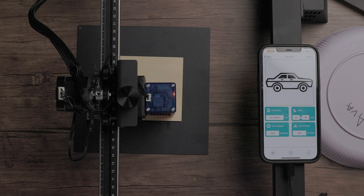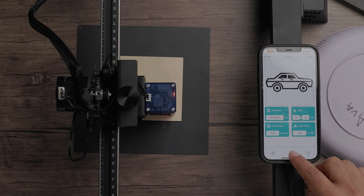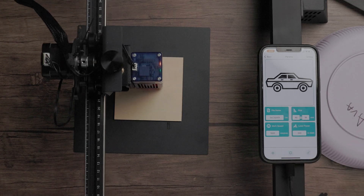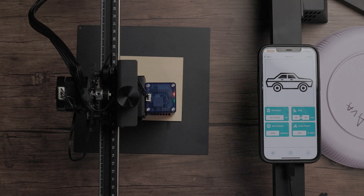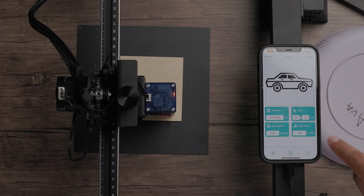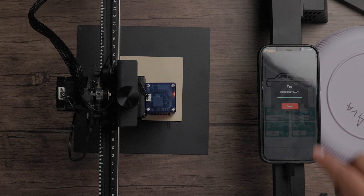We'll go to next. Here you can adjust the size. There's a little frame button to show how big the image is going to be. The image looks pretty small. We have the file name, the size, the work speed, and our laser is going to be at 500. When uploading to your control panel, you need a micro SD card in it so the image can be sent to the card for the control panel to read.